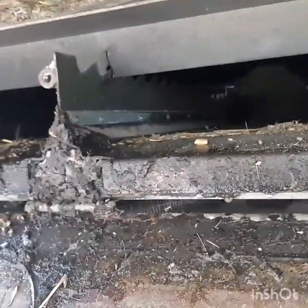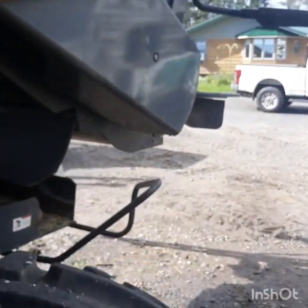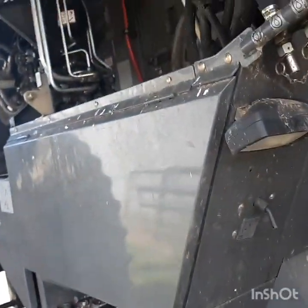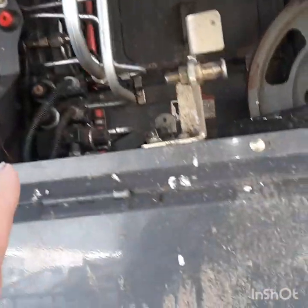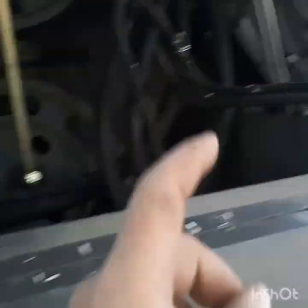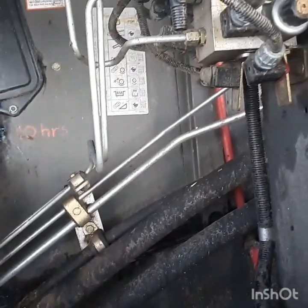Coming out here behind is our impeller to feed the rotors. The rotors start here and go all the way out the back, and the gearboxes are sitting up in there — they're a long, long rotor. Those rotors in length are actually longer than a New Holland twin rotor, except the New Holland has to do threshing and then separating, where we've got two modes of threshing up front. You can see the cylinder shaft is down here, here's the impeller shaft, and it just works its way up into the rotors and out the back.